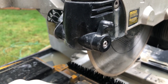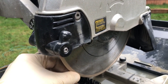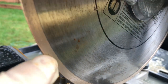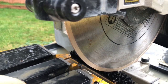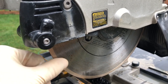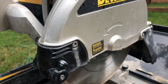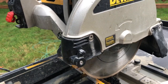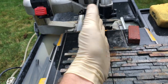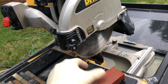This little 3/8 inch part is what cuts the tile; all the rest of it is just metal and doesn't cut anything. The more cuts you make, you can see little diamonds everywhere — that's what cuts your material. What happens is the material builds up a thin coat on top of the blade edge until it covers it completely. Then your blade doesn't want to cut, or it starts bending and flexing, so you can't get a straight or perfect cut. That buildup on the blade is the reason.